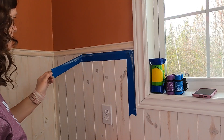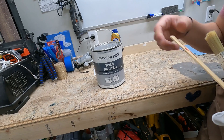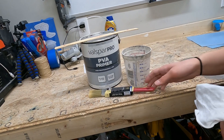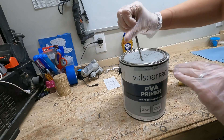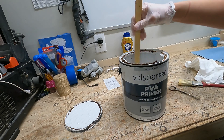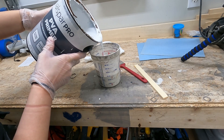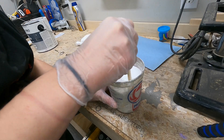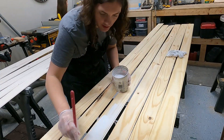To make my own whitewash, I just use a white primer. You're going to need a stir stick, a cup with measurements, and to apply it you'll also need a paintbrush and a rag. When I make my own whitewash, I always use a one-to-one ratio. You fill up the paint to your desired line — so if I'm going to eight ounces, I fill up my cup to the eight-ounce line, and then bring it over to the sink and fill up the water until I reach 16. So I have one part paint, one part water. Then you stir it up — it's going to be super watery, and that's how it's supposed to be. That's all there is to making your own whitewash.